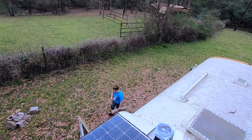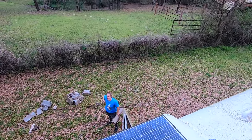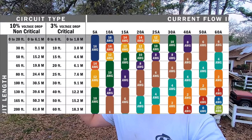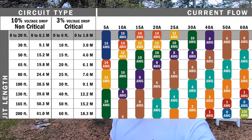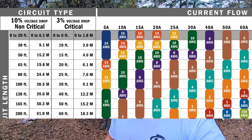90% of the time it works. We also looked up a wire gauge chart that tells you, for a 12-volt system, what gauge wire to use based on the length of wire and the max amp load it's going to carry.